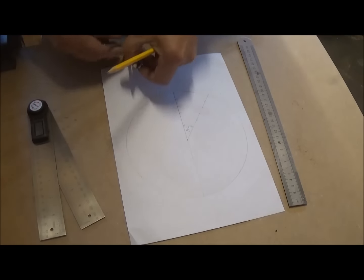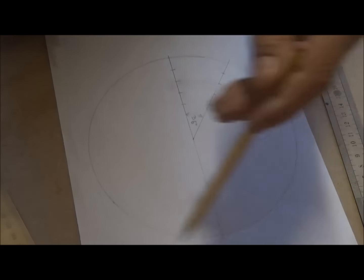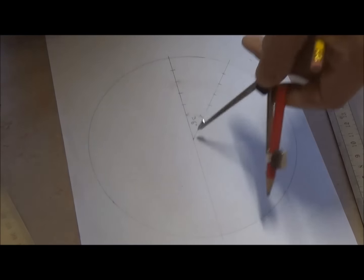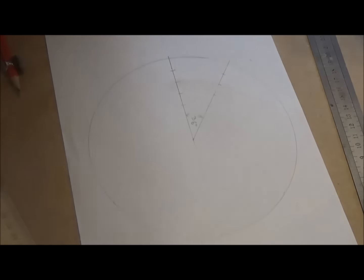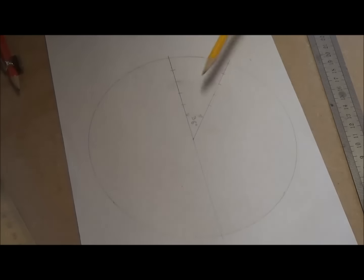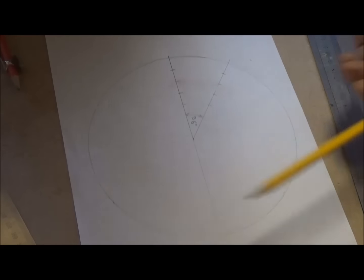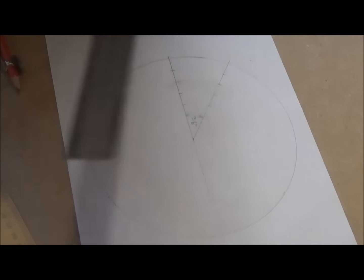To start, I'm going to do a 10-segment ring. This circle is about seven inches, so you get your compass and draw yourself a circle however wide you want your segmented ring to be. Now every circle has had 360 degrees in it since the beginning of time, and always will. So however many segments you want, you divide that into 360. To keep things simple, 10 into 360 is 36. Draw a line with your ruler right through the centre of the circle.